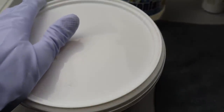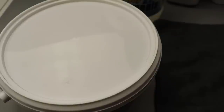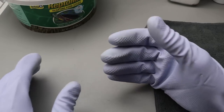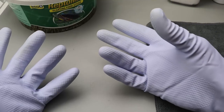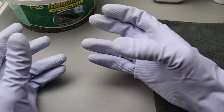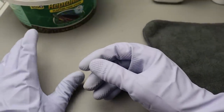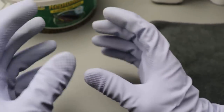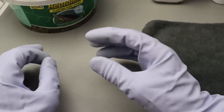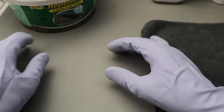I'm going to wait this out even longer than I typically would before I check, because a lot of times what happens is you check it too early and if you lift it and move it around, you're going to stop it from being at its most beautiful. Even though it'll look really, really good when you take it out, once you put it back down its pattern is going to end up differently. If you just leave it for like six to eight hours, it will get a really good coating with really bright copper still. Some people like to put clear coat or clear nail polish in a certain pattern so that part of the copper doesn't patina. I'm doing it in a natural way — whatever patinas, patinas.